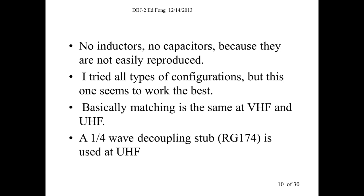And in fact, what's strange is I've seen some good ham antennas, not commercial, by major manufacturers start using capacitors for matching, and ceramic ones. I've torn apart the X200, which has two capacitors in it. They're ceramic. They're not even micas. I mean, how can that possibly work? I don't know, because you can't use those for matching. At HF you can, but not at UHF. And I have those antennas. Yeah, they don't work as clean.